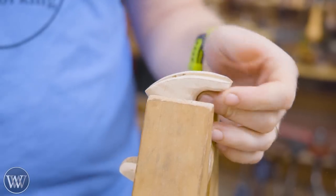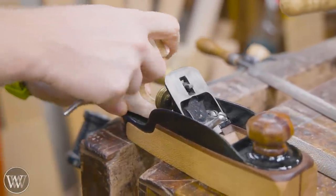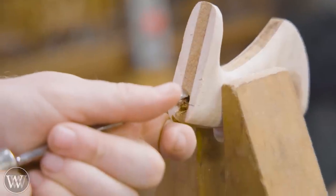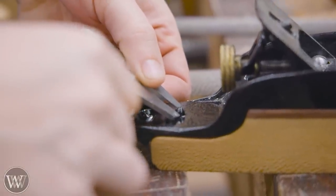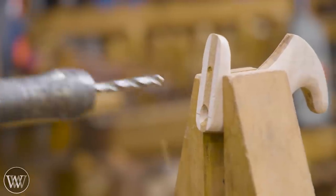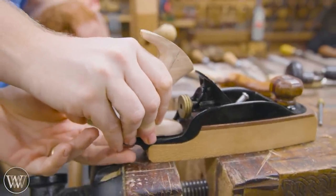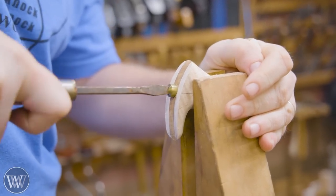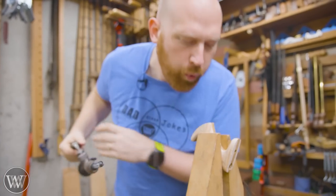There's no right or wrong way — no perfect shape — because every hand is different. The most important thing is that it feels good in your hand. I'm leaving it a little bit fat because I haven't fit it into the plane body yet and I want to make sure it will work in there. There's also a little nub in the front it has to recess into, so I'm going to drill a tiny hole for that. The recess wasn't quite large enough so I used a gouge to make it a bit bigger to fit the threaded insert. I can find exactly where that nub needs to be, drill a small dimple, put it in place, check it out, put the screw in, and verify it looks right.